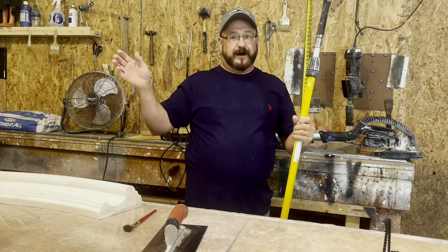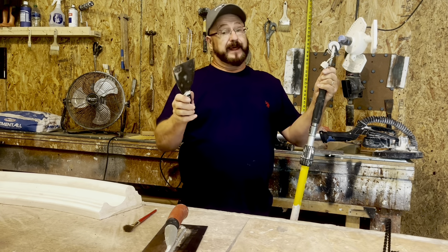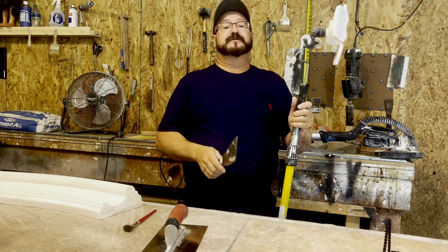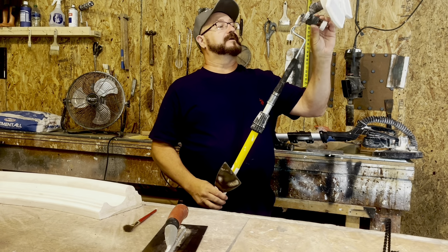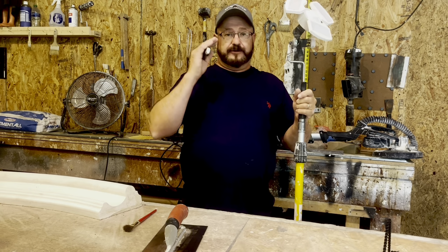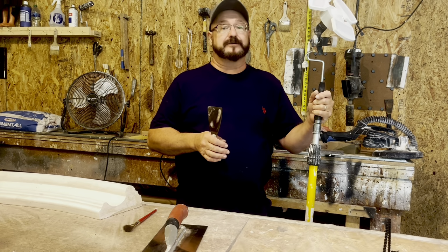It shows any flaws. If you'll touch it up before your final buffing or sanding, and we're talking about using hot mud so you can lightly sand it. But if you'll touch it up, go through and use the light. I gotta fix that a little bit. But if you go through and use a light, hold it up on the ceiling, touch it up, you don't have to worry about when it's painted, somebody calling you back. It'll be done right. You can see it.